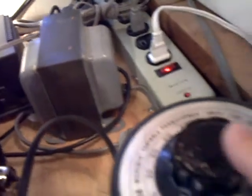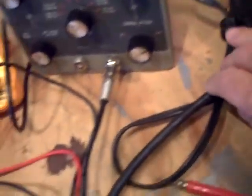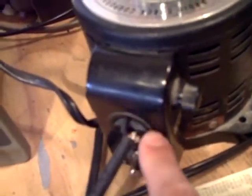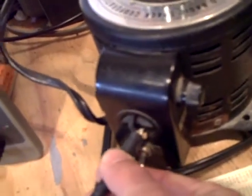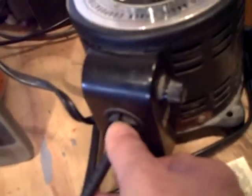I'm going to power it up — there's the plug for the isolation transformer. The isolation transformer is here and the Variac is plugged into that. I'm going to turn it on. I also had to make this cable here because I wasn't getting a good contact with the socket anymore — it's worn out. So I soldered the wires directly into the appropriate places inside the Variac and brought the wires out through the terminal holes, which makes a much better connection.